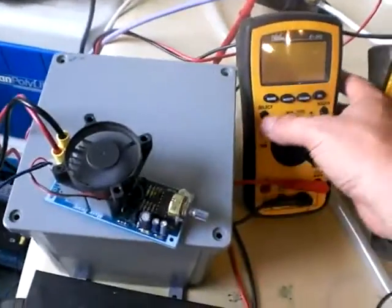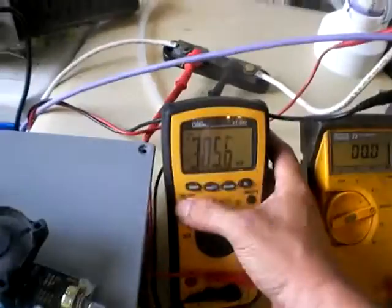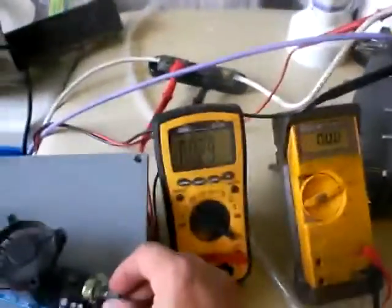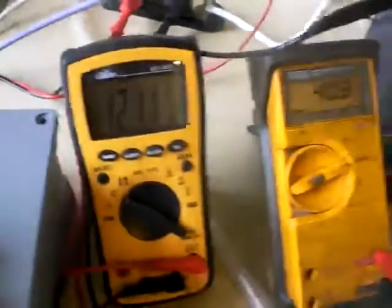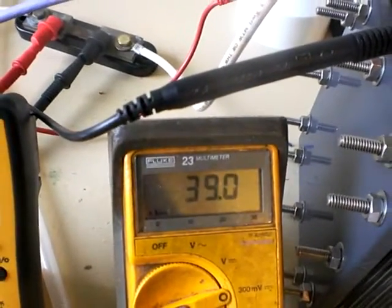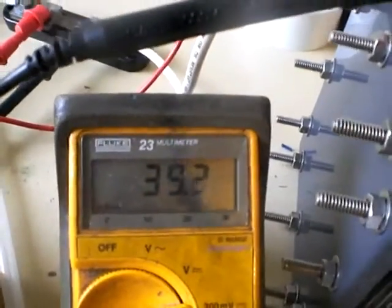Let's just fire it up. I want volts — I don't want it to keep auto-ranging, so I'm going to go straight to full max. Ease it up nice and slow. Remember that my amp draw is actually half that number right there, so we're looking at just under 20 amps. There's my gas flowing. Starting volts I'm going to mark as 12.64; starting amps I'm going to mark as 39.2. I'll fix the math later.